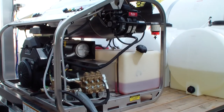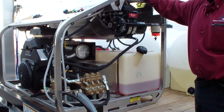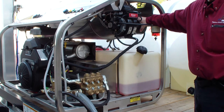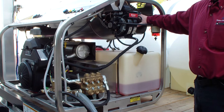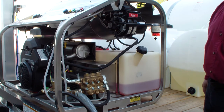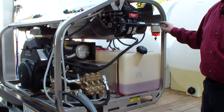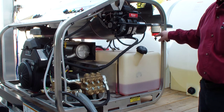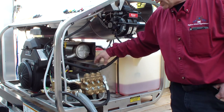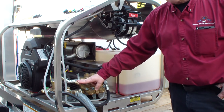On this side, from top down, you have your 115-volt burner system with a Beckett burner. You can tell by the large motor size and durability — these last a lot longer than 12-volt systems. You have your diesel fuel filter cartridge with oil-water separator; open the valve here to drain any water you see in the fuel bowl. You have your diesel fuel tank on this side, plus your belt guard and pump. It's a split belt guard, so it's easy to pull off and service.